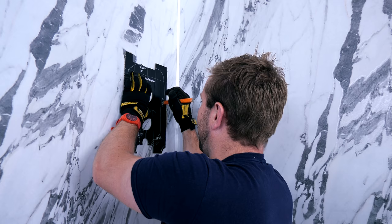Do not over-tighten these fittings. Remember, we're going onto a plastic spigot here, so you want to make sure that you just do them up nice and soft. Once you've done that, turn the water on and make sure that you've got no leaks before moving on to the next stage. The electrical connections are effectively like wiring up a massive, heavy-going plug, but there are rules and regulations that you have to follow further back down the line. Electric showers draw a large amount of current — they need to be properly tripped and RCD'd, and also have a pull-cord switch inside the shower room. For these reasons, you will need to get a qualified electrician to come in and do this side of the installation. Once you've got that done, seal up around the holes with some mastic.